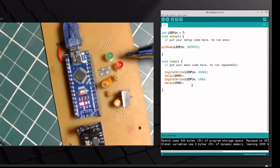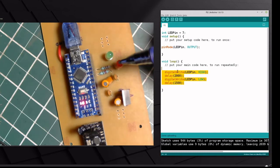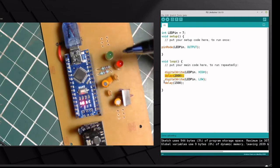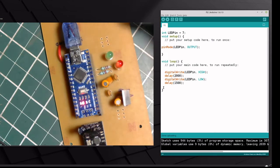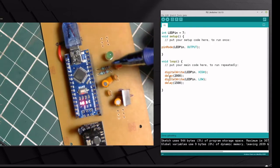That's pretty straightforward — a very basic Arduino sketch. But think about this: supposing I wanted to flash the green LED also, at a completely different rate from the red LED. This sketch would suddenly become a lot more complicated, because you'd have to keep track of when the green LED flashed on and off. The biggest problem is this delay() function. This whole video is about how to get rid of delay() and achieve independently flashing LEDs at whatever rate you want.